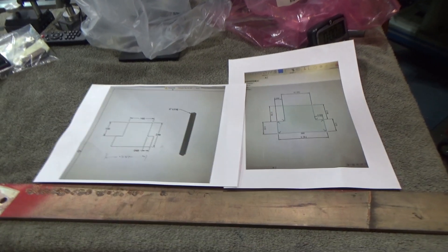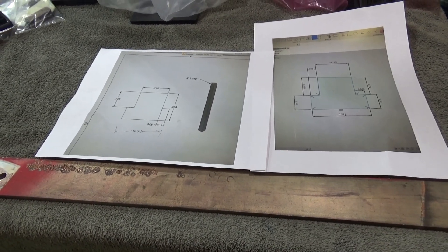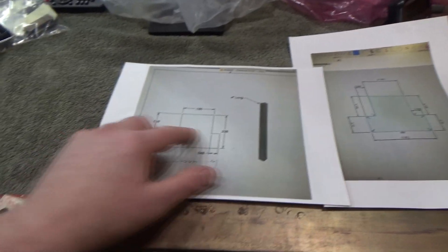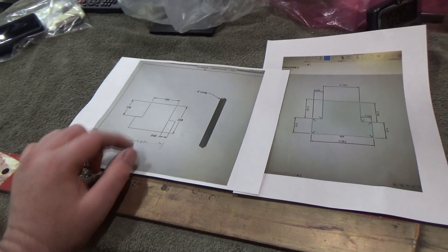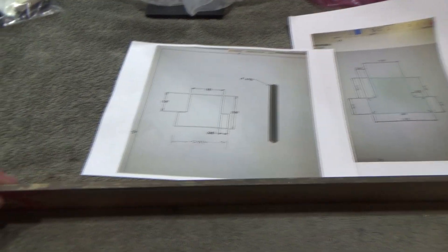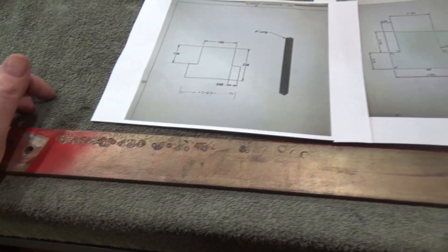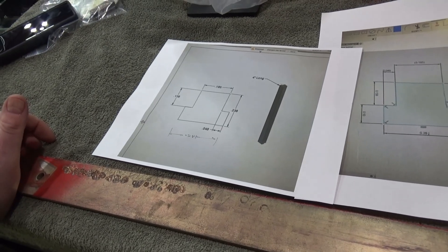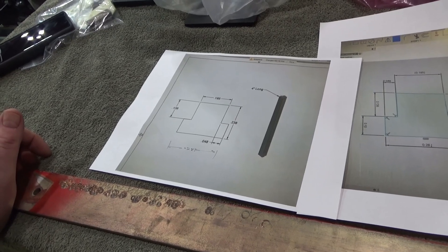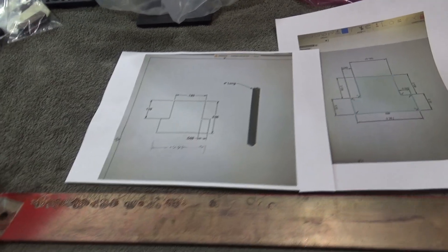Hi and welcome. This time we have an interesting project — a fairly simple looking T-slot shape profile piece, four inches long. But look at the dimensions: 0.281 by 0.238 thick, four inches long. That means it'll fit in this quarter inch bus bar, and it's only going to take a tiny section of it. The issue is how do I hold this thing? Workholding is definitely going to be a challenge. It's going to be a custom heat sink.